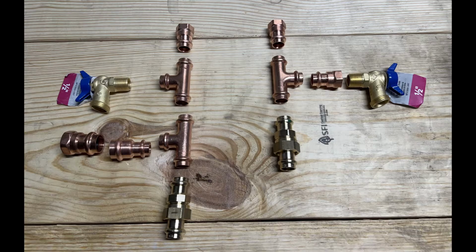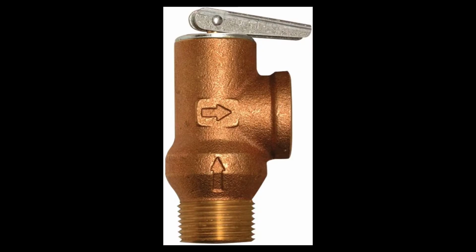release valve, which you don't see in the picture, but it is a 3/8 fitting, so we use a 1/2 inch to 3/8 converter and a pressure adapter again to connect the pressure release valve. Just in case there's ever too much pressure buildup, it just releases some water into the drain.